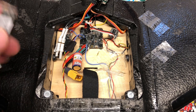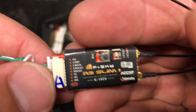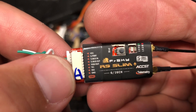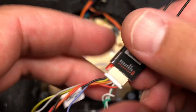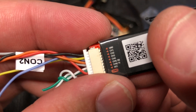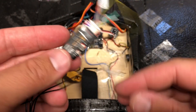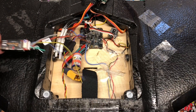The Slim Plus has the ability to go PWM. On the top line you can see VCC, S port, S plus N, S plus L, RSSI, TX1, RX1 — that's good for quads and whatever else. On the bottom you've got two sets of pins: ground, channel one, two, three, four, five, six, and VCC. So you're going to be able to use this receiver PWM.